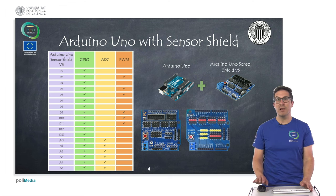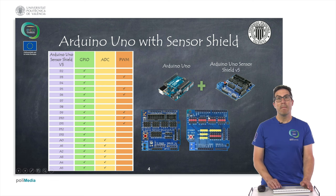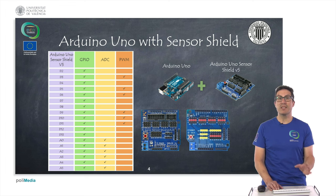As you can see, this row marked with V is a power pin, and this row marked with G is a ground pin. This also applies to a different kind of board that is essentially the same. One important thing to know about Arduino Uno is that not all pins can be used for any purpose. All pins can be used as digital input and output signals, but only specific pins named A0 to A5 can be used as analog inputs. Only a few specific pins can be used as PWM pins, because they have dedicated hardware resources to generate these kinds of signals.